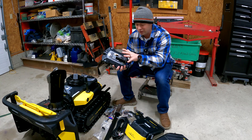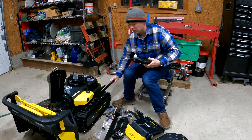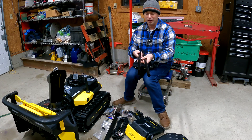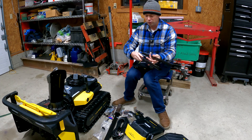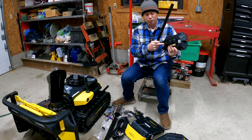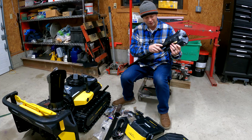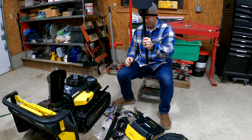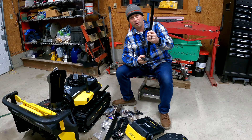This is how it came assembled — all the stuff's already bolted on. It comes with two poles: a main pole and an extension pole. They're almost identical, but one has a slot for the cabling. These snap together with little push locks, and you can also install set screws after snapping them together for a more permanent install. Once locked in place, you have the option of putting it directly on a flat mount, which is probably how I'm going to mount it.